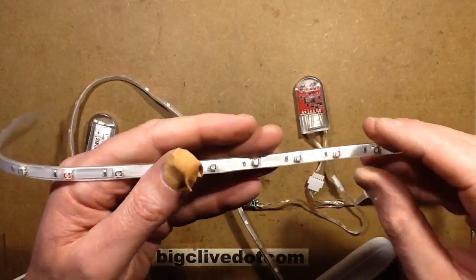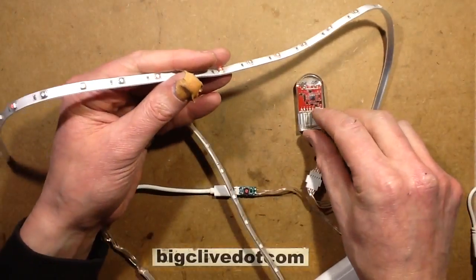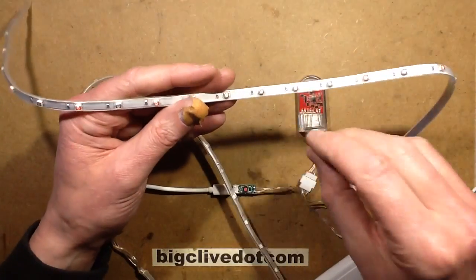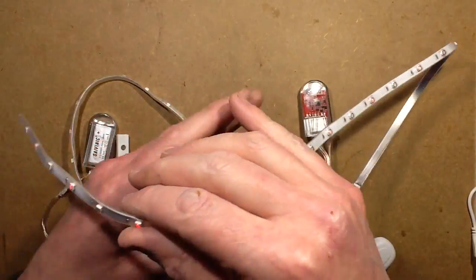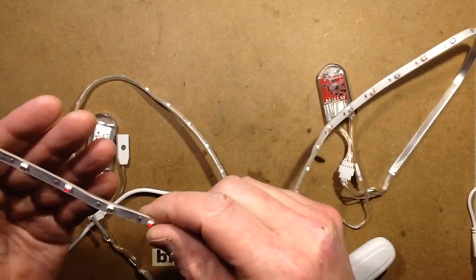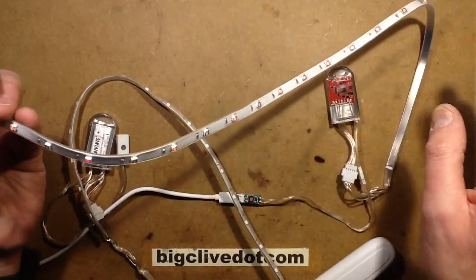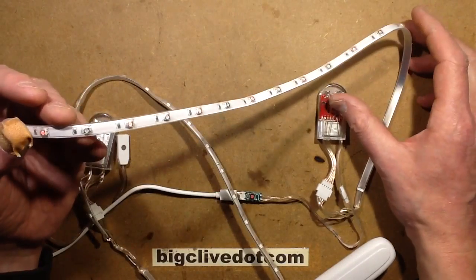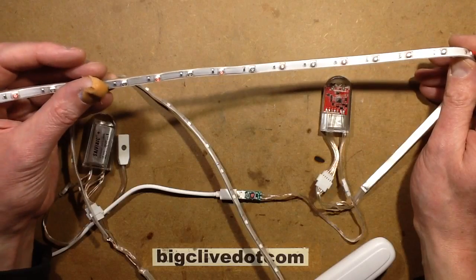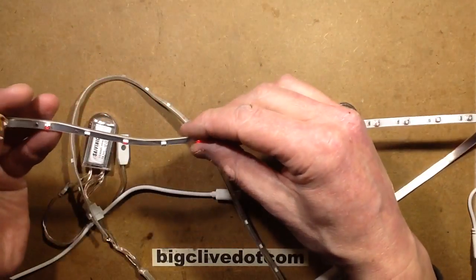But while this is charging, it glows red. I get the feeling maybe it's just a diode, not just feeding the lithium charging circuitry, but also maybe through a resistor feeding a small amount of current to these. Initially I thought it was under microprocessor control, but there's no visible pulse width modulation at all unless it's happening very fast. The other option is, I wonder if it detects the end of charge state. The only way you can find that out is to leave it on charge until the end. It'd be nice if that turned green to show it was fully charged. That would be quite smart.